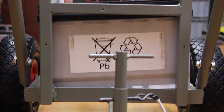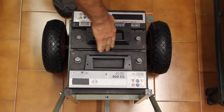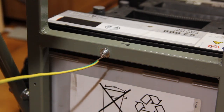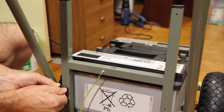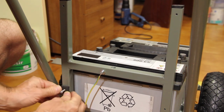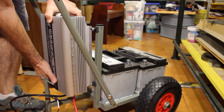It's time to install the batteries and to connect the ground wire to the inverter. To damp vibrations, the inverter is fixed through rubber dampers. They are made using high-density adhesive sponge and a rubber hose, the same used in gardening.